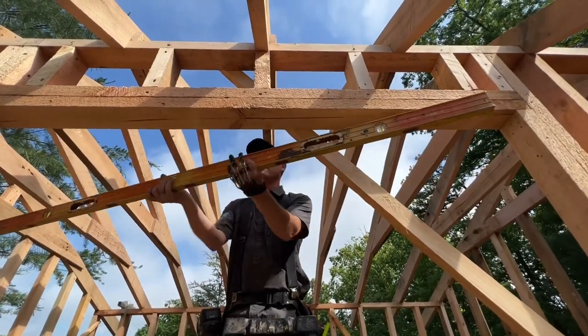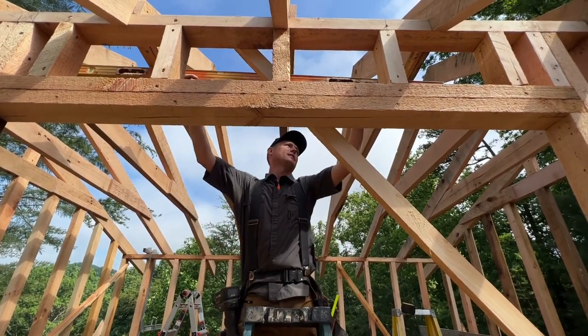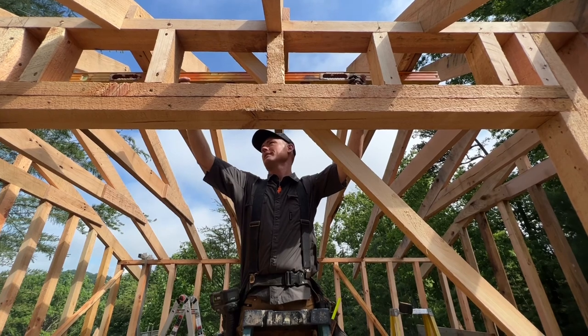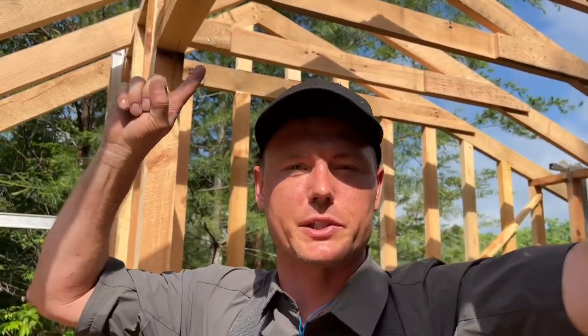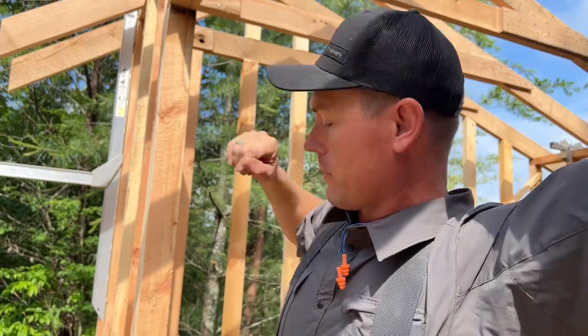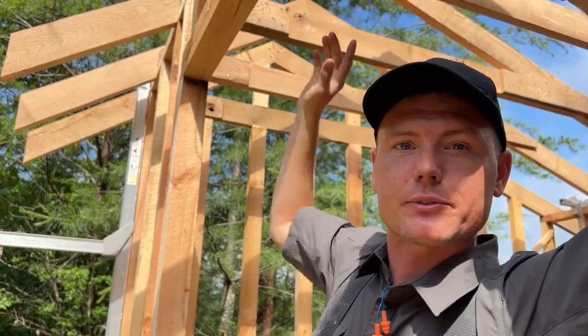This one's sagging down or the wall behind it is up — just the tiniest bit. The one dead center is showing low. You can see my header on this six-foot door only has two flat two-by-fours — about four and a quarter total. I'm not sure if it's sagging or if we built it that way. What I'm going to do is put a jack in, push up a little pressure, and then put in diagonal bracing — like a little truss. That's what they would have done in the old days without big heavy timber headers: diagonal braces like a modern truss to make it stiff.